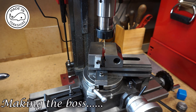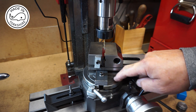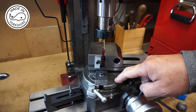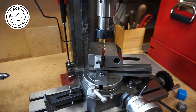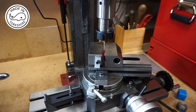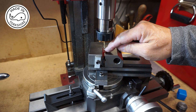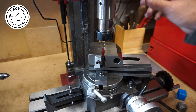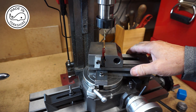It took me a while to work out how to centre the crosshead up on the rotary table. I centred up the rotary table first and then I've decided to put my vice on and let everything be loose, and just slightly move this 2.5mm drill bit into where the thread is. Then I've just gradually tightened everything up. I've only got one clamp here on the vice but it's pretty rock solid, so I think we'll be okay to carry out the milling.